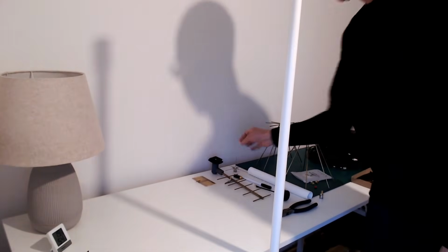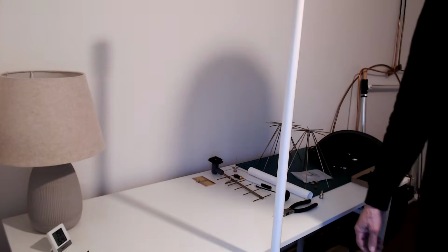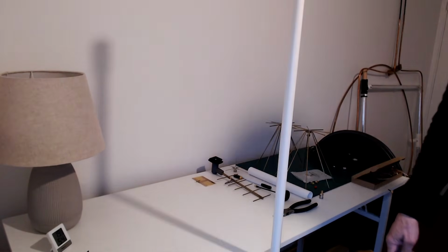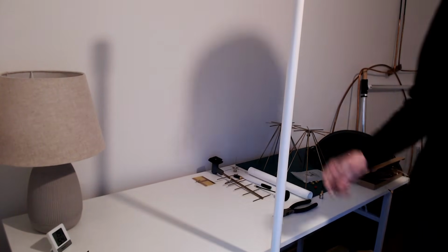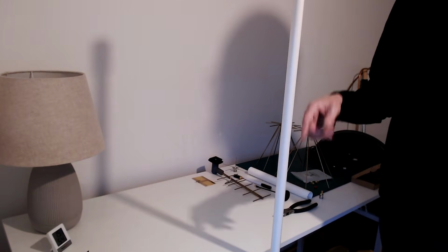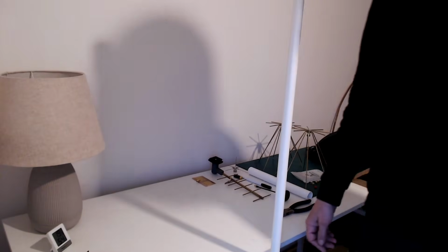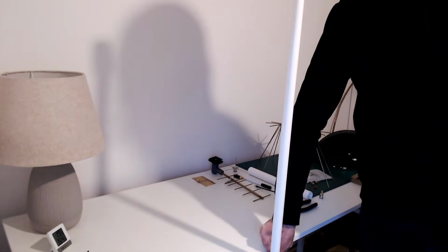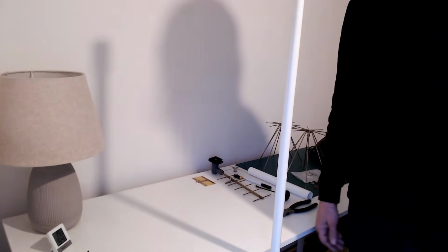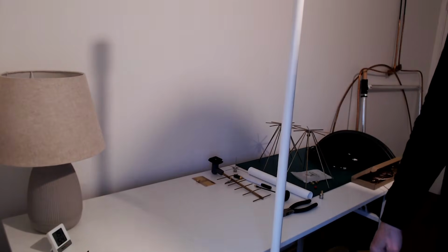So this is minus 32. It looks like 8 dBs of gain over the ground plane, but again, it's very subjective. It's all relative, but probably minus 32. And perhaps not quite as good as that, but it's interesting because it's obviously got gain. I don't know how many elements are in here. I'll ask the owner, and I'll put that in the description. But it certainly works, and even when it's close to the table, which has a metal piece underneath, which I'm sure is detuning it. So it looks like minus 32 dB, which is impressive.